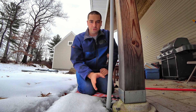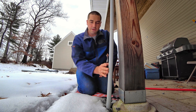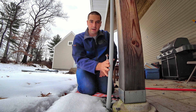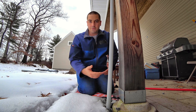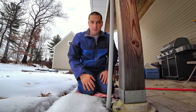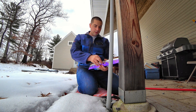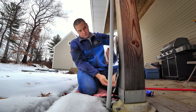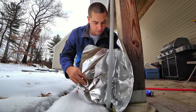What I thought I would try to do is heat this up and see if I can get it just pliable enough that I can kind of bring it in close, tie it off, and then let it cool up against the post. And if that doesn't work and I kink the pipe or the conduit, well no big deal — I'll just cut it out and put some 45s in.